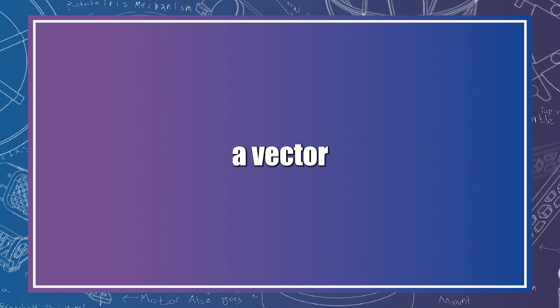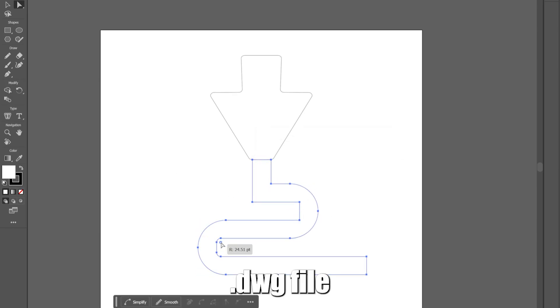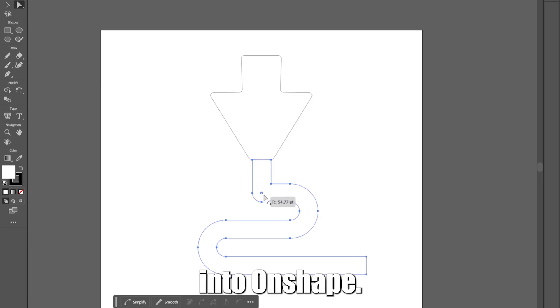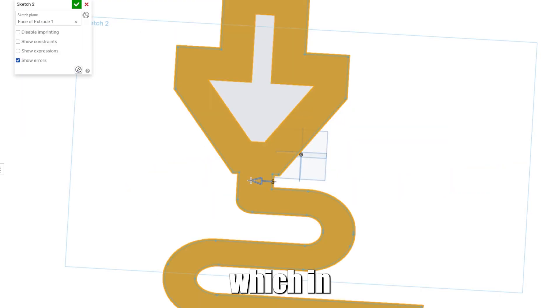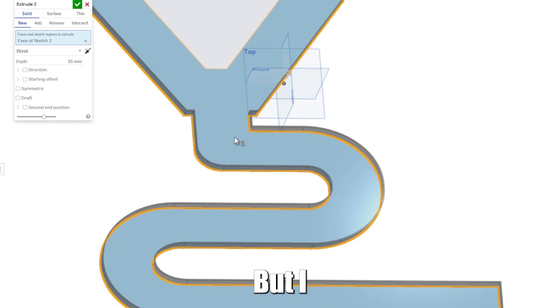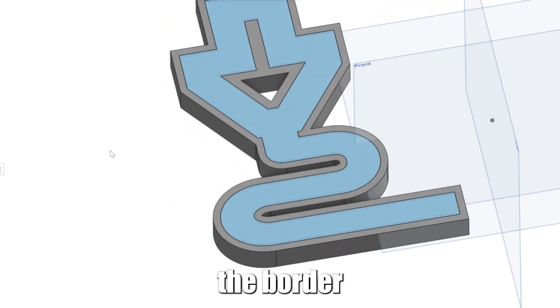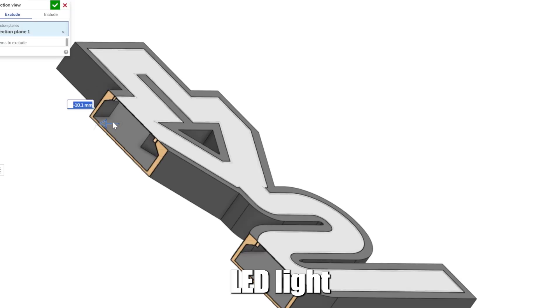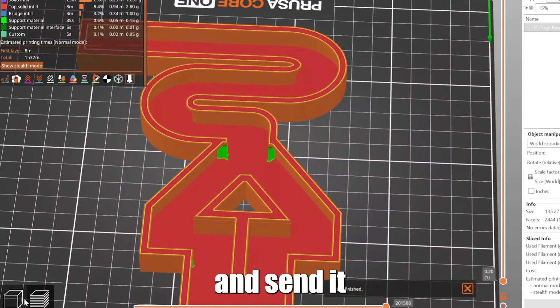For the design portion, you'll need a vector graphics editor, a 3D modeling software, and a slicer. I personally used Adobe Illustrator, Onshape, and PrusaSlicer. I used Illustrator to create my vector image of a nozzle, exported it as a .svg file, and imported it into Onshape. I used this shape to create a screen — to start, I made the screen the height of one layer, which in my case is 0.15 millimeters — but I made sure it was easy to change later, because spoiler alert, I change it later. Next, the border is made and indents are added for the LED light strip to slot into. Then we add it to the slicer, slice it, and send it to the printer.